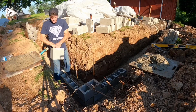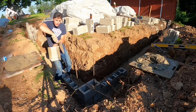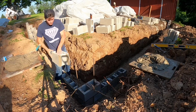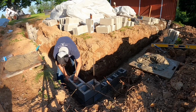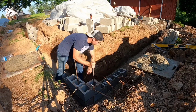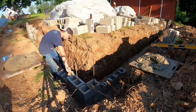I always head these ones before I put them on the wall. In, out, you gotta get it to bite the inside of these webs, and then go on the outside and it'll stick no problem. Same thing, you just sight down, and when you look down these cores, there's a little opening like this. You gotta put the center on that opening. That's called bond. Again, you can clean your mud up, reuse it.